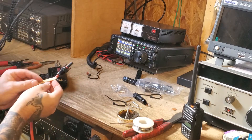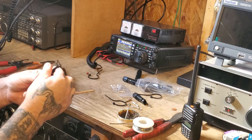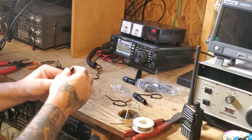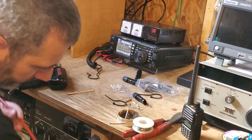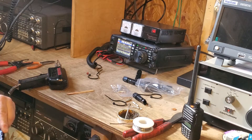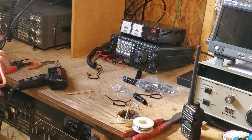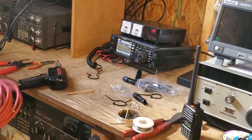These things can fool you, as you just saw, so you need to check them — you don't want to have a problem with your own. They do have a little tool that will fit on these, but I find I can grip it good enough. And that's how you do it. You just do the other one the same way — it's real simple. Now I have an extension with a male and female. Waterproof, IP65 I think they might say on them. Anyway, that's how you do these MC4s. Thanks for watching.